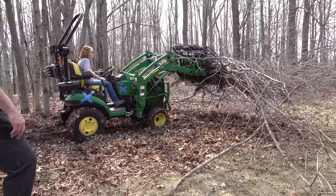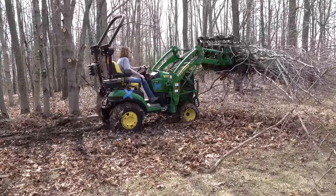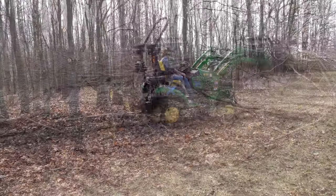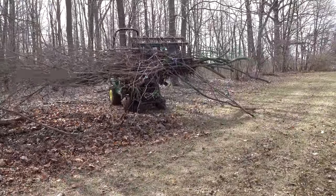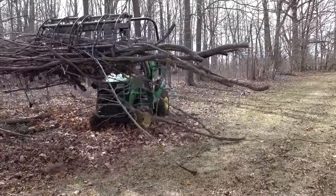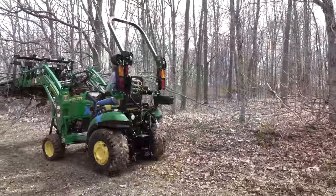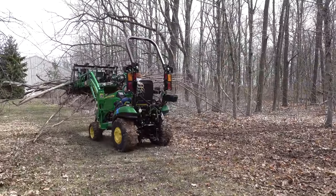Yeah, the third function kit, this is a weakness of it. You'll never get the two functions at once with the third function kit on these tractors. With a diverter, even though theoretically you cannot do two functions at once, it's actually easier in practice because you can just simply let off the button and push the button, basically toggle it back and forth.